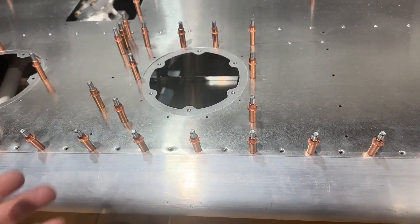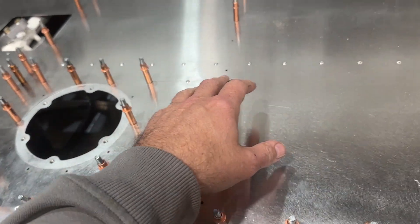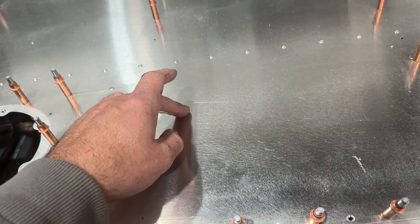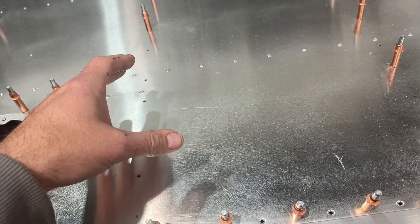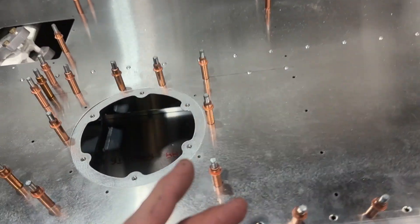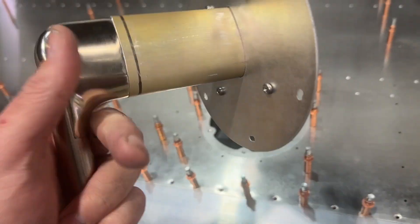If you're doing anything more substantial like a Garmin or the Dynon, you've got to come up with something. I've looked at what a few builders were doing — they were coming out here or maybe going inboard — attaching it, cutting an airfoil shape in the skin, creating some bracketry and structure off of a rib and mounting it out there. I'd considered that, but I wanted to do something easier and use the existing inspection hole cover, kind of like RANS has you do, but find a way to mount this thing.